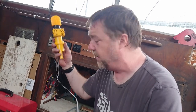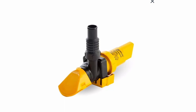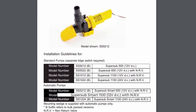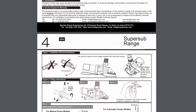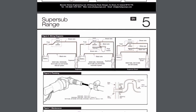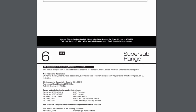We've got to get rid of it, and here is the device we're going to use. It's from the Whale Super Sub range — a very low profile narrow electric bilge pump. Mine is the Super Sub Smart 1100, 12 volt DC, with non-return valve. The 'Smart' refers to the automatic switch, meaning the pump will sense the presence of water, switch on, and turn off again when the water level has dropped. The switching is solid state with no moving parts, and it's also got a time delay so it doesn't start and stop every time the boat rolls a wave of bilge water over the switch.